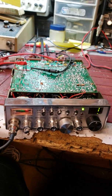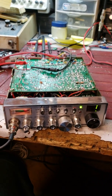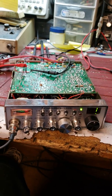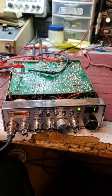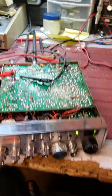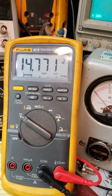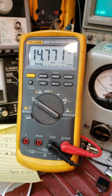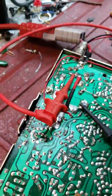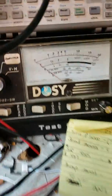What we got here is probably the baddest Bird average Cobra 29 I've ever built. It's not the strongest peak power, but for average — which was the goal — it's probably the best we've ever produced. I figured we'd do a video, and I'll probably do something to quiet it down a little bit. Just got a voltage reference at 14.77 volts, hooked straight to a hot trace and ground trace inside the radio.